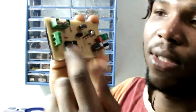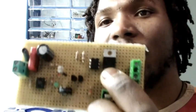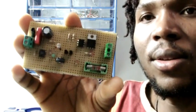From here, the rest is all the switching circuit. We don't use a relay here — there are no moving parts. I'm using a BTA-136 triac, so no relay is needed — it's a solid-state switching circuit.